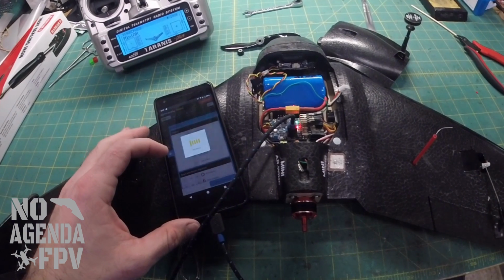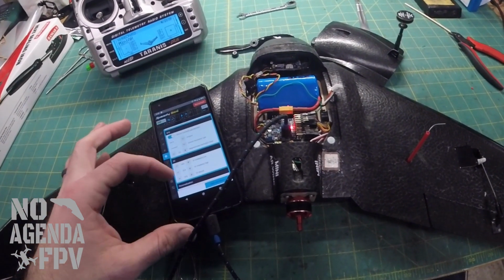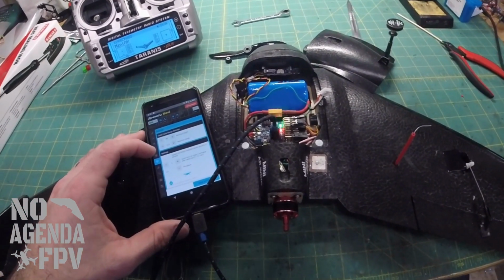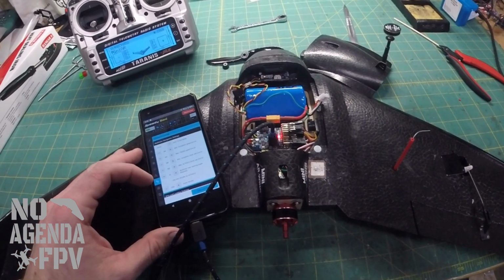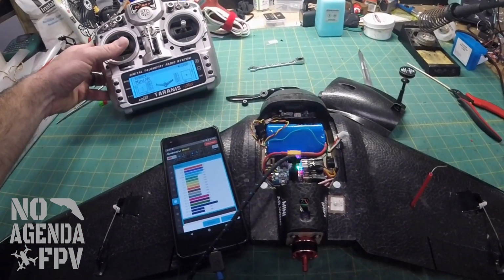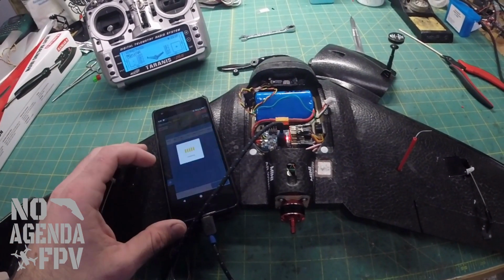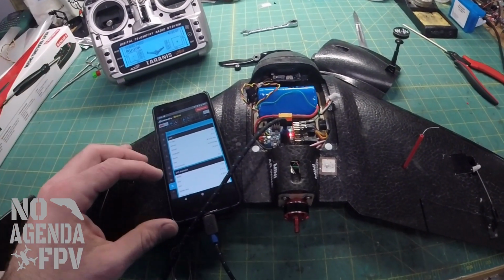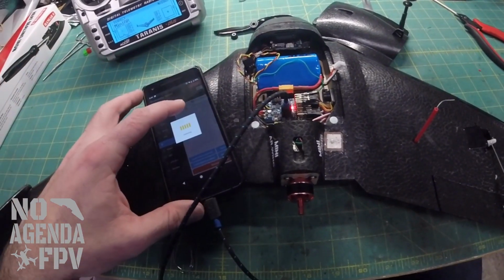ports, configuration for what you got turned on, your board rotation, all that kind of stuff, GPS, all the stuff that's in the actual configurator. Failsafe, you got your PIDs, excuse me, advanced tuning, receiver tab, it all reads your modes, servo settings, satellites, got 8 satellites. This is a really good one. I actually used this for the first time earlier today.